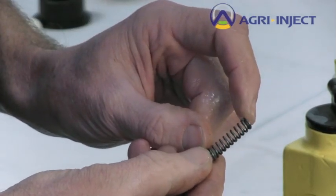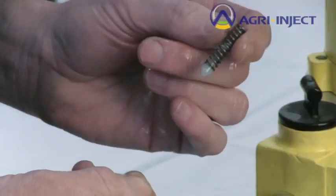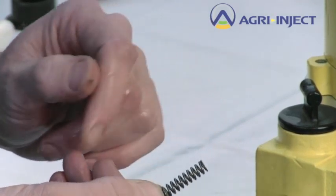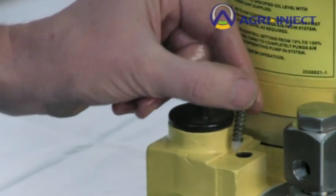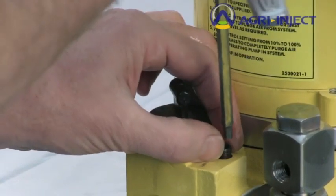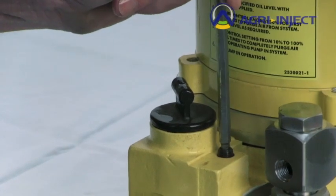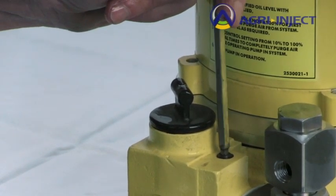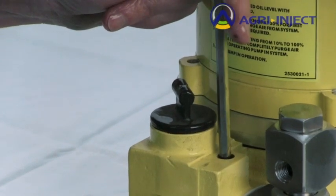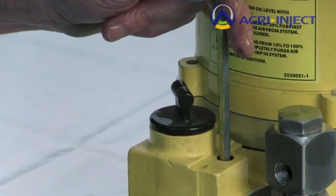Your spring on the AP series should be about 1-1/8 inch long. If it has been over-tightened, your number of turns would have to be increased to keep the pump working at the same pressures. So if the spring is less than 1-1/8 inch, we recommend replacing it also. Just drop it in place and make sure you count your full turns from the set screw sitting on top of the pump to get your correct pressures — 14 turns.